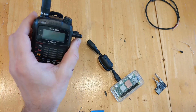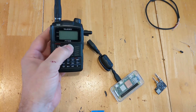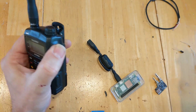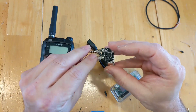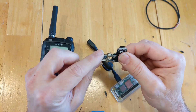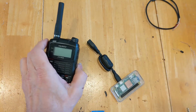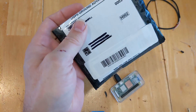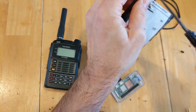We need a bunch of parts. Yaesu does it a little interestingly in that they multiplex one line between the microphone and the push-to-talk pin, so we really only need three wires and a couple of components. We're going to leverage the AIOC device — the all-in-one cable that has USB plus audio in, audio out, push-to-talk, and ground. But we're not going to use those prongs because we're using a Yaesu. I happen to have a brand new AIOC that doesn't have those prongs on it, and we're going to see if we can solder onto those pads.